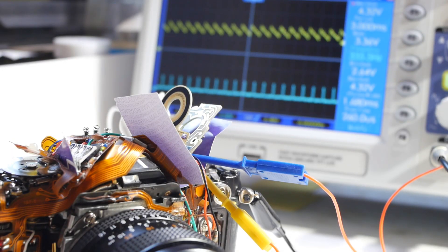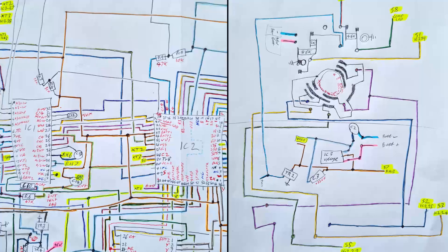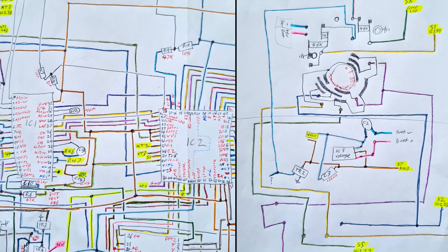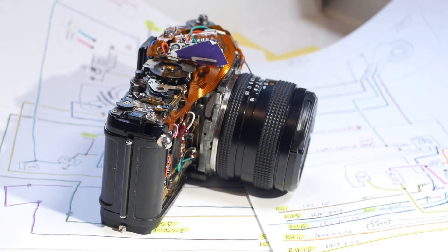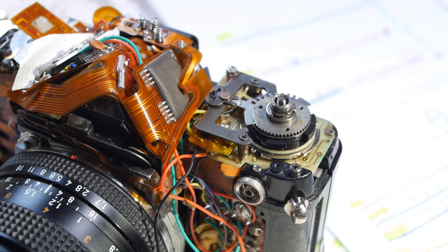I wasn't getting a good ground to the shutter speed board while it isn't bolted to the chassis, and now I have. That is ugly. Blue is on the middle pin of the voltage regulator, and yellow is on the output. When the camera is turned on, the blue trace should remain grounded by the transistor. Unfortunately, no matter how hard I stare at my circuit diagram, I don't know which chip actually turns the camera on — it will either be IC1 or IC2, but with no documentation on either of those I'm at a bit of a loss right now. After that I just went round in circles, testing what I could think of and basically getting nowhere. I swapped the two capacitors that are supposed to prevent the voltage regulator from oscillating, and that did nothing. I put the speed selector and ISO resistor boards back together in case that made a difference, but it didn't. So I gave up and went to bed.